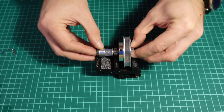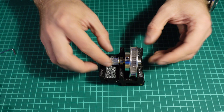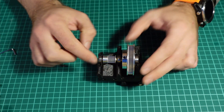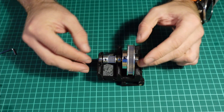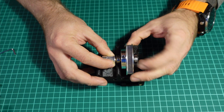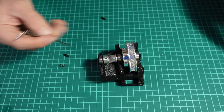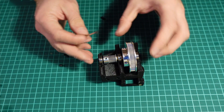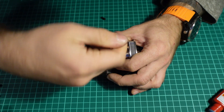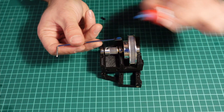Now put it into the frame to align it properly. You don't want your rod sticking out too much — you want both pulleys able to rotate freely. You want your pulleys pressed together against the middle bearing. When you've done all that, start fixing your pulleys, and don't forget to apply some thread locking compound. Start by fixing the smaller pulley, then continue with the big one, also with thread locking compound.